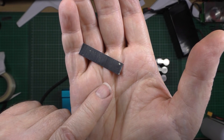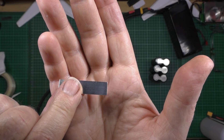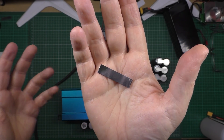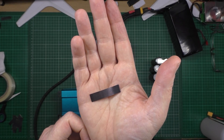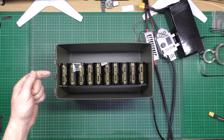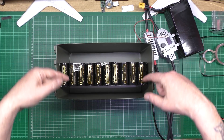I can't stress the importance of cleaning the nickel strips. When you've cut them, if there's a burr and you try to weld over it, it'll crack — makes a hell of a crack. Always clean both sides every single time. This isn't a race, it's a marathon — you've really got to take your time and make sure everything is perfect. Preparation is key. Make sure everything is completely clean before you spot weld, otherwise it won't work properly.